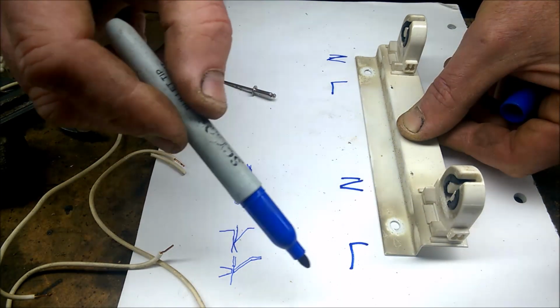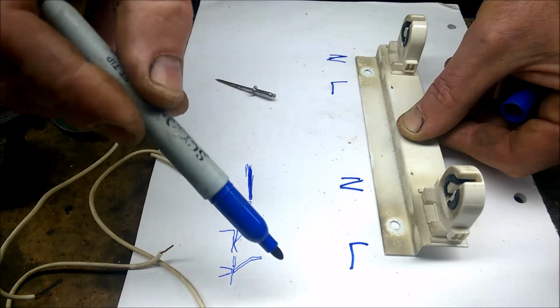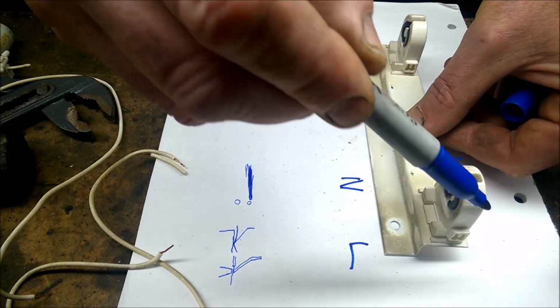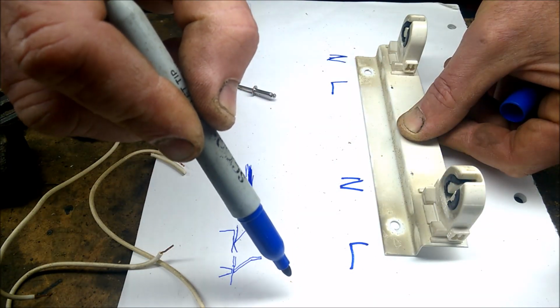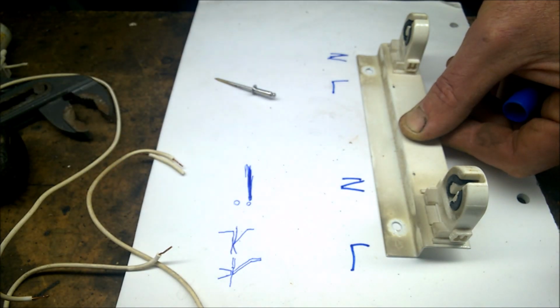So what I'm going to do is pull a loop in around here from these two wires, so I've got enough, and I'm going to chop them so I've got enough to reconnect into here. Then from there onwards, where I've cut them this side, I'll pull back out the rest of the wiring from the chokes and the capacitors and stuff like that.